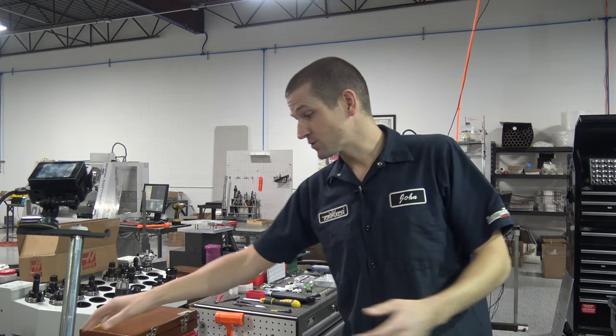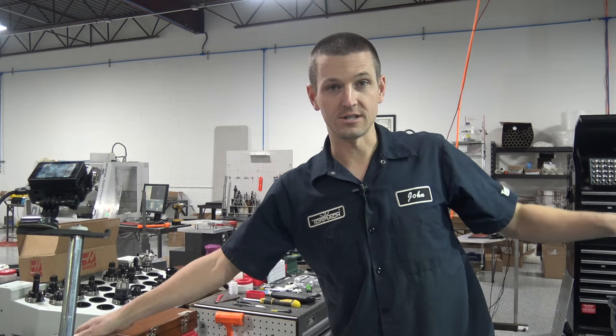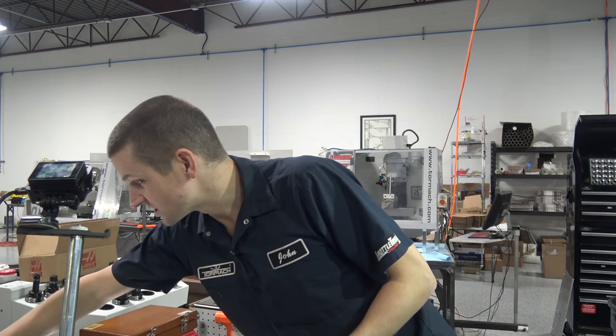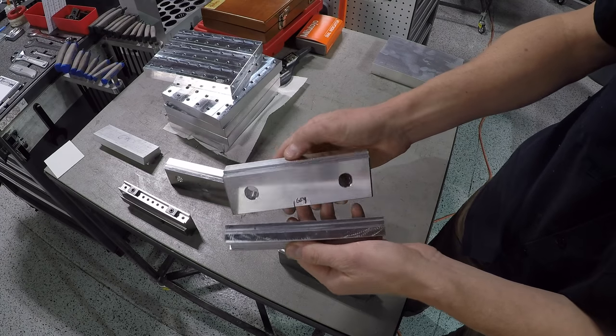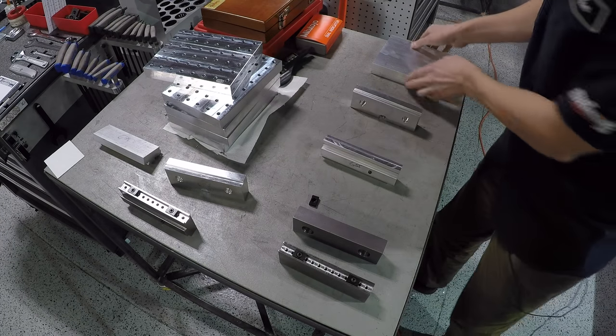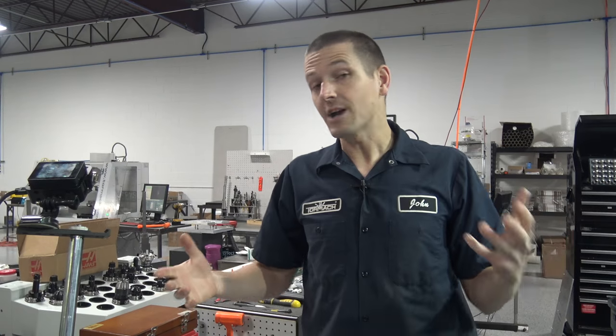Hi folks. As we've been making our mini pallets, we've been starting to tool up and understand how to do this as a production job. So when we first started, we just used some machine steps in these soft jaws to hold our block of raw material. And that actually worked fine, but I wanted something more secure long-term. You know, with aluminum like this, it's gonna deform, or they're gonna wear out, and oil in there, I just wasn't confident that that would be a good long-term solution.